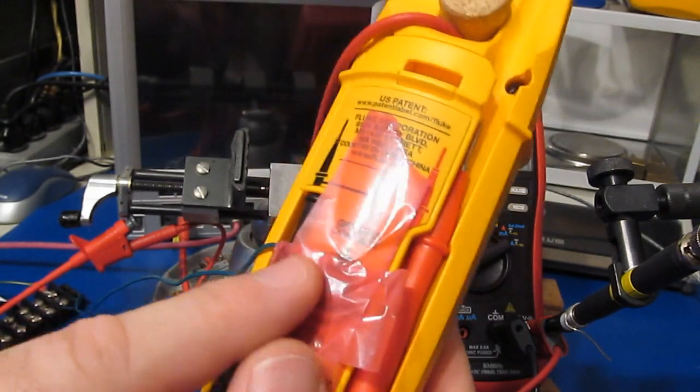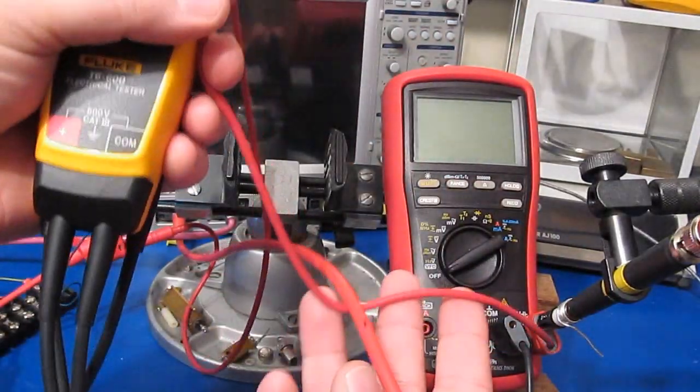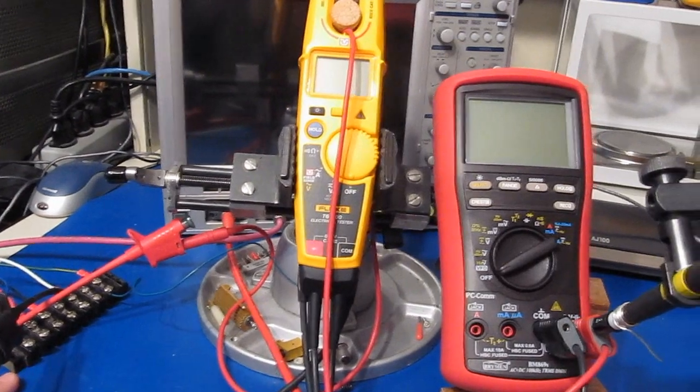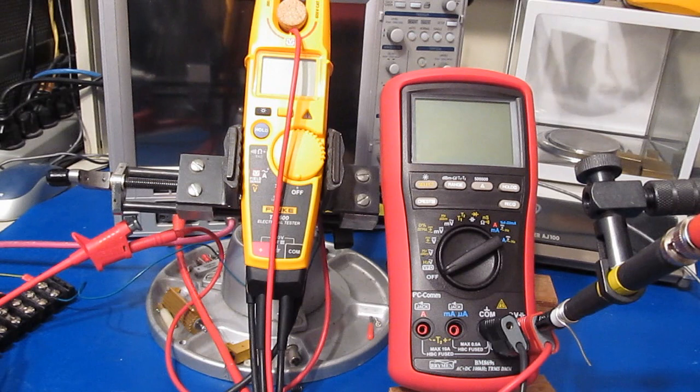So here you can see I have a small grounding wire attached with a spring to the small button in the back — this is the test lead going down to the Brymen. I'm just going to use that as our pickup wire. We're going to be running this with the ARB, and that comes off to this bus bar over here. We'll be monitoring the output voltage using this Brymen BM869S. I wrote a LabVIEW application that's going to cycle through several waveforms. We'll program the amplitude of each waveform to 240, 120, and 24 volts, set the frequency to 40 and 80 hertz, and also AM modulate each waveform with a 20% depth using a sine wave with the 9th harmonic of the fundamental frequency.